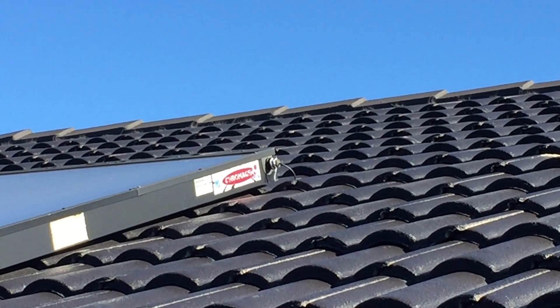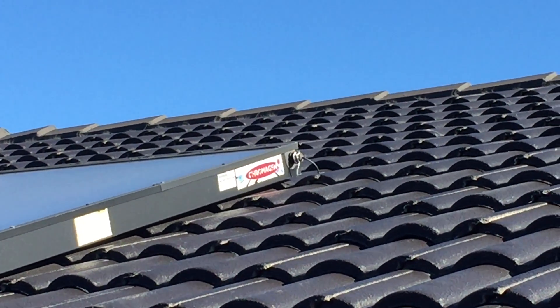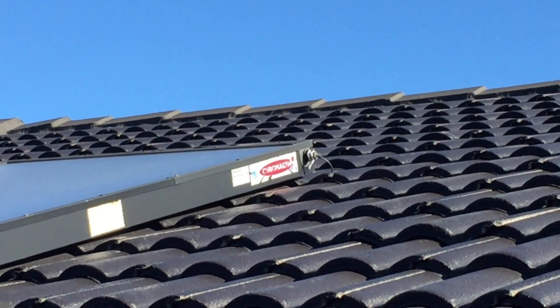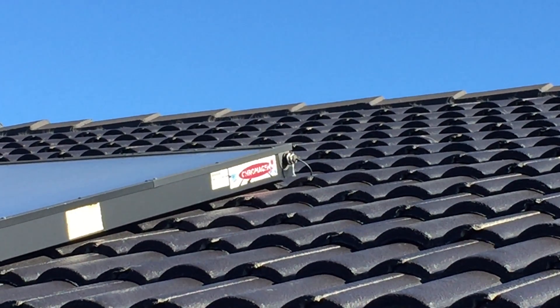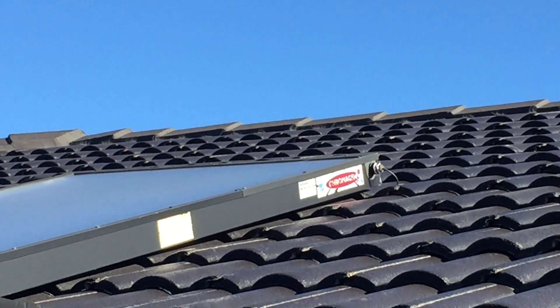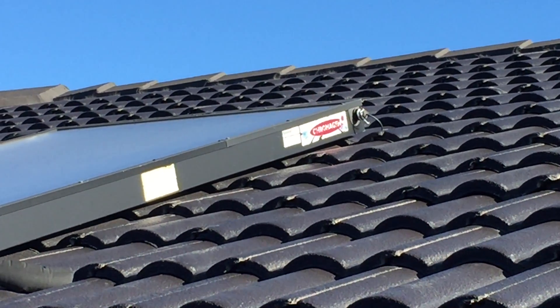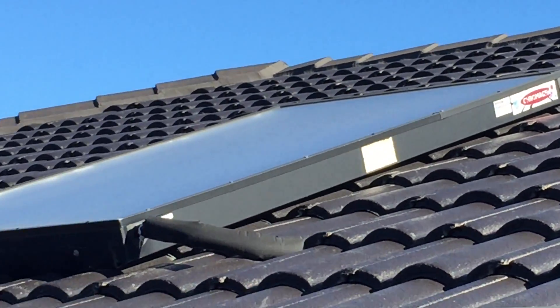There's the key bits of it - there's a sensor. Make sure that sensor is not wrapped around a hot water return wire, as that is a common fault. I spoke to the Chromagen service guy when he came out and he said that was a very common fault with these things, and those sensor wires get destroyed. Funnily enough, on the Chromagen unit, that is just an RCA plug - as in what you've got on your stereo - so they're ones you can get yourself and repair.